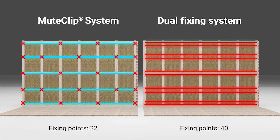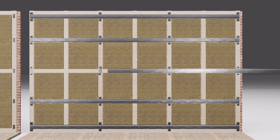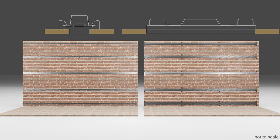You'll need to create two perfectly parallel lines — one for the top fixing and one for the bottom. You may notice that we will now need to ensure each clip is fixed perfectly vertical. If one fixing point is off centre your row will no longer match up and the channel can't be fitted. A common selling point for the dual fixing clip is that the system is slimmer. While this is true, we believe this could lead to the drum effect. Our channel is fitted with a two centimetre gap between it and the wall, designed to provide space to snugly fit acoustic mineral wool behind the channels.